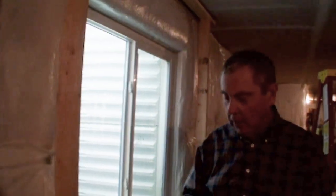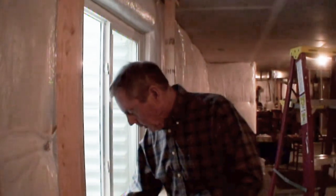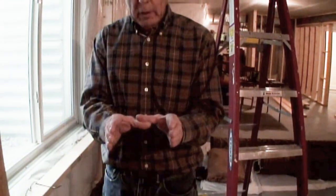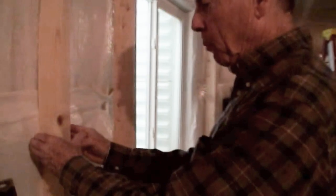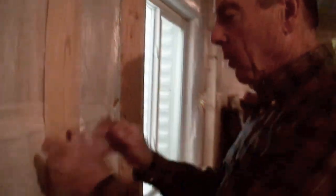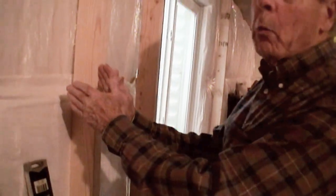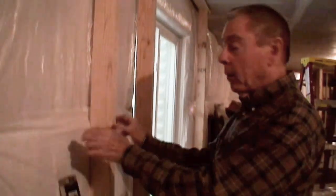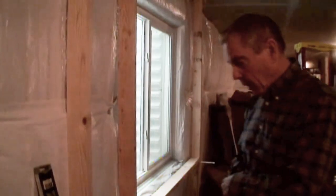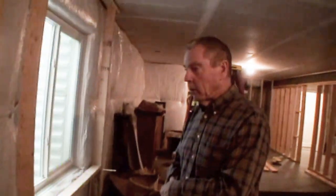But you have to have, I'll show you, the diagram is two boards like that and a board going between them. That's the same width. So you've got a situation like this. When you look at it from the side, it's board, and board across. So your wall goes right into that board across, and you still have 1.5 inches on either side for screwing. Oh, how about that? All right. So that's typically the way a junction is built.